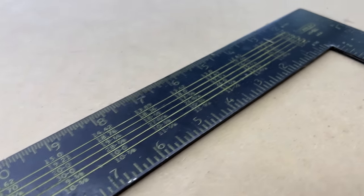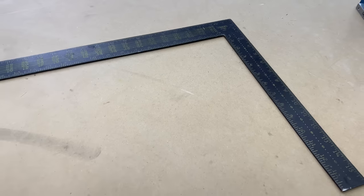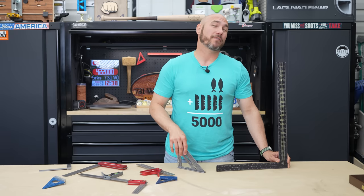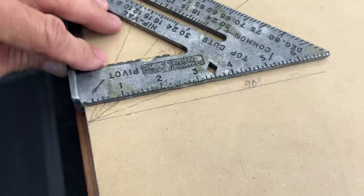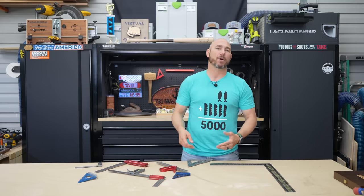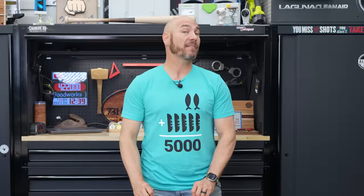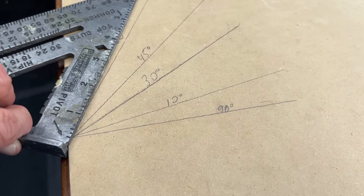You may need a bigger square from time to time, and a framing square is what you'll want to get. These are very inexpensive and it's just a good starting point. These two squares will accomplish a lot, and you can usually pick up both for less than $20 together. A couple of features of the Speed Square: it has a shoulder so you can lay it on top of a 2x4, 2x6, or any other stock and make that mark. It also has graduated marks up the edge so you can pivot it down to whatever angle you need to cut, make that mark, and you're good to go.